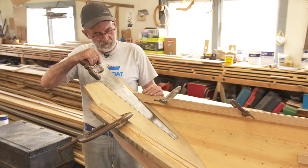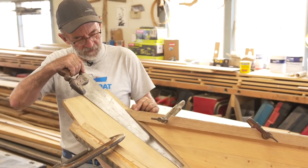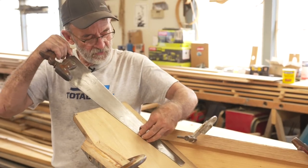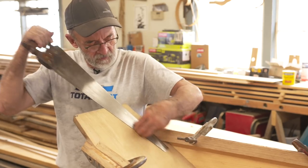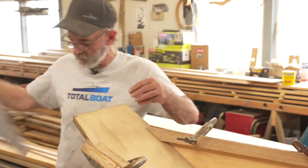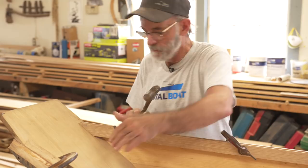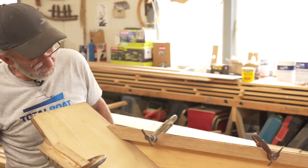What the saw fit requires is that I use the transom to guide the saw. I'm going to saw the end of the in-wale off again right at the very end. If I was a little crude cutting it, it might take a couple of passes to get it to fit exactly right. I'm making sure I don't cut into the transom — I'm using the transom as a guide. And now you see it passed right through. Whatever it was bumping into has been relieved. I can knock it down and there it is — one cut and it fits.